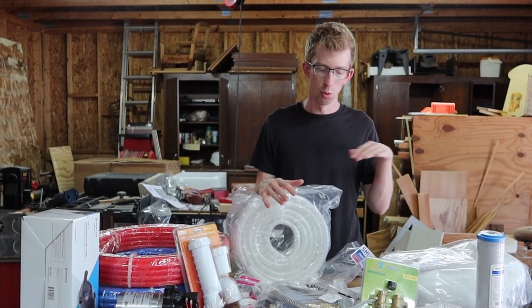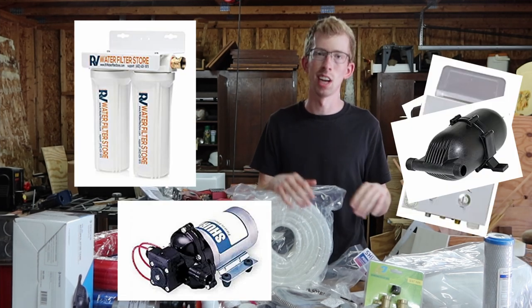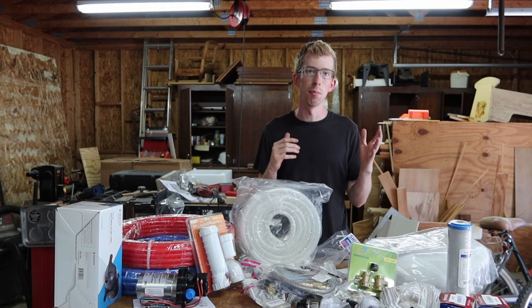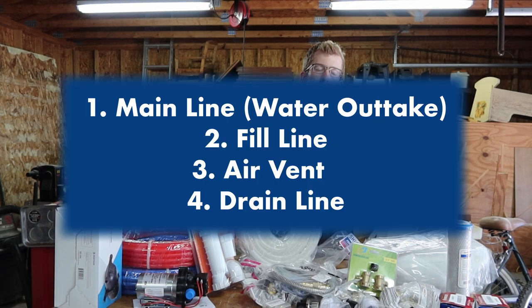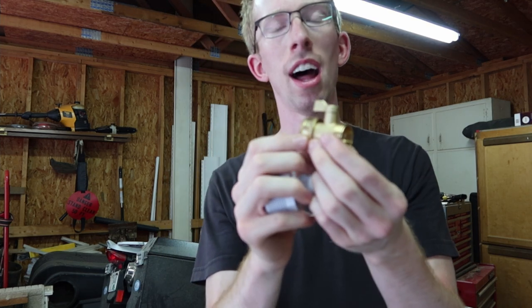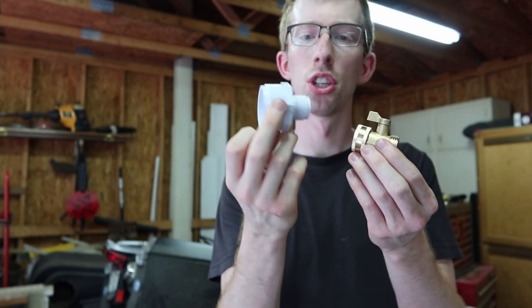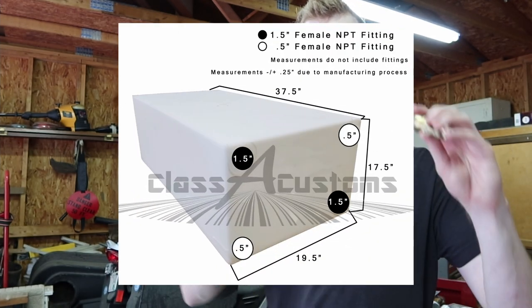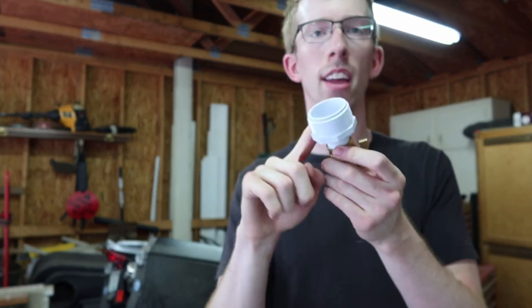It does look like a lot, but we have a lot of components in here like water filters, pumps, et cetera, that kind of all use their own fittings. Based on our research, this is what we came up with. Basically the water tanks have four fittings in the order of most to least complex: it's the main water line, then we've got the fill line, the air vent, and then the drain line that we would only use for emergencies or when cleaning out the tank. I'm going to start off with the easiest thing and install the drain line. It's really simple — just a garden hose valve with an on-off switch and then a one-and-a-half inch to half inch pipe reducer. The Class A Customs water tanks have two valves that are half inch, but the other two are one and a half. So pretty much everything I bought uses the half inch pipe fitting. I just bought these reducers so that it can fit with all my other fittings — I'll screw this on and add it directly to our water tank.